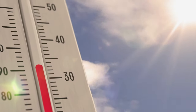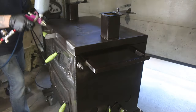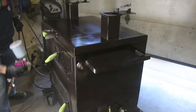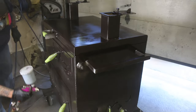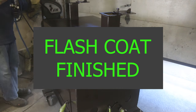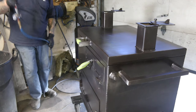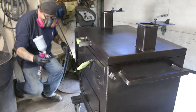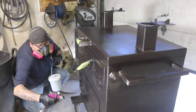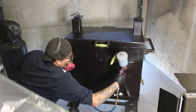My shop is heated, so I never spray a smoker in less than 15 degrees Celsius, or 60 degrees Fahrenheit. As you can see, I take my time during the first full coat. I get a nice thick coat on everything before stopping and letting it dry a bit. The flash time — meaning the time it takes for the acetone to evaporate — is what I mean by drying. The coating itself isn't drying, just to be clear.